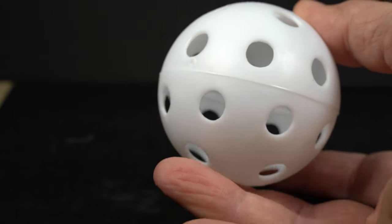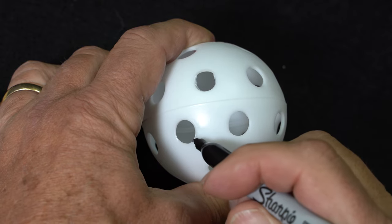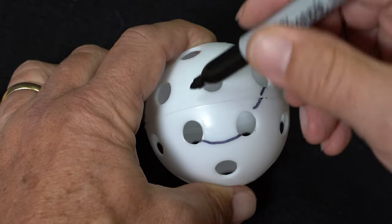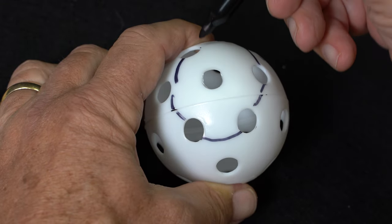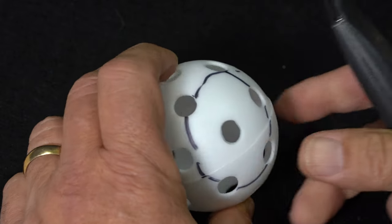We're going to use 2 on the top and 2 on the bottom for the hair bands holding the mic capsules. Before we do that, we're going to cut back a section that we will later glue back on, and we will install the cold shoe mount. This is going in the bottom hole and locked down with a 1/4-inch nut and washer.